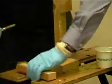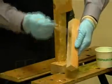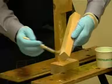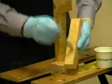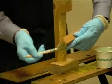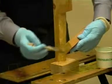In the case of timber splicing, Dry Fix should be applied to all contact sides. It is essential that Dry Fix is used in all repairs. When splicing, ensure that the timber splice is slightly roughed up if it's a smooth surface to aid the penetration and adhesion of the Dry Fix and Dry Flex.